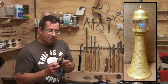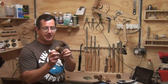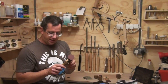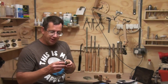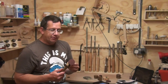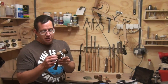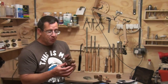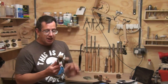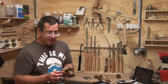And my only concern on that was that these bearings, I mean, this looks absolutely amazing now. The spinning on that is absolutely amazing. But the bearings do have a little bit of friction to them. Before I got the head on, it didn't spin so well. So that was my first worry, really, whether the bearings were going to be good enough. So the bearings I already had. The main bolts I had, I mean, that's a coach bolt through this side to lock off the neck at whatever angle you want. That was my last one on there. They were long ones, and as you see in the video, I just cut them back with the rotary tool.